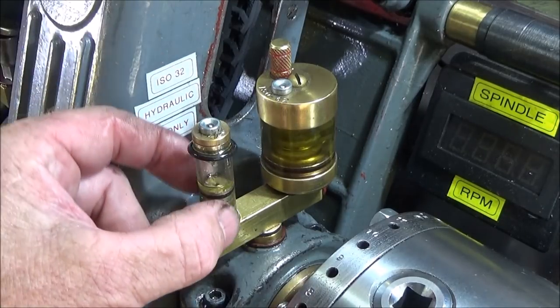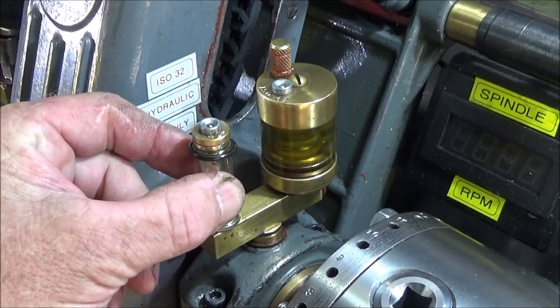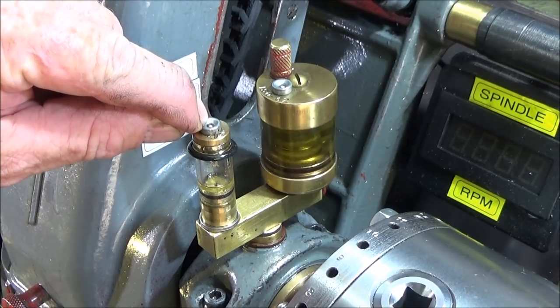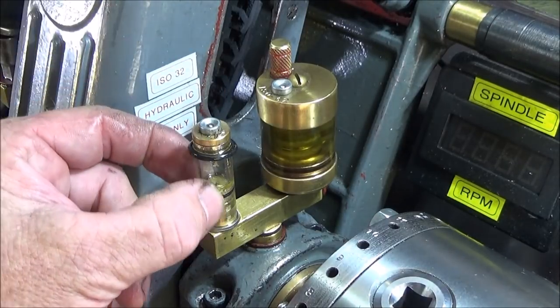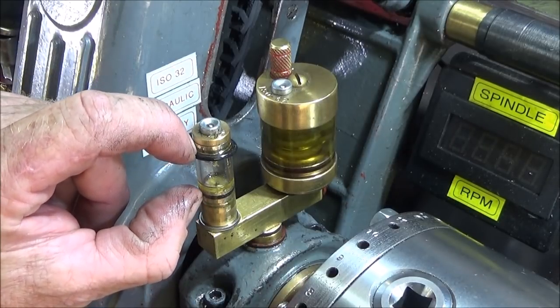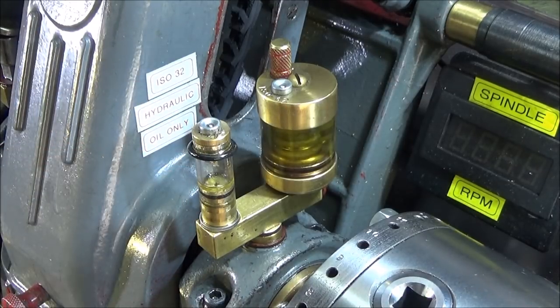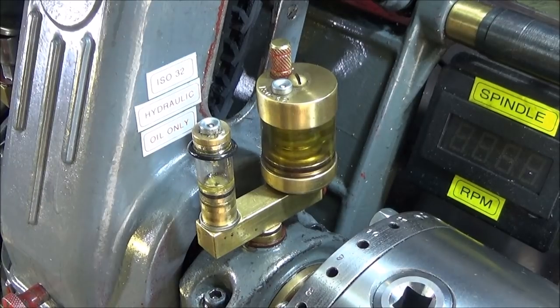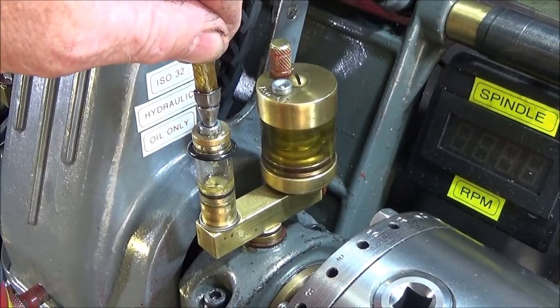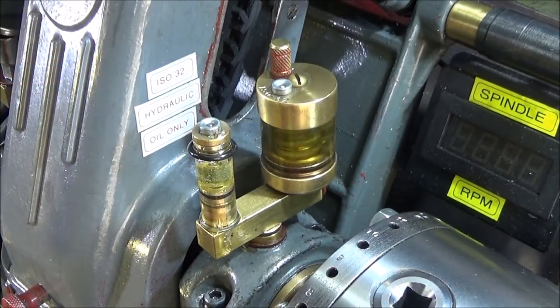And this is an ordinary straight through hole in a polycarbonate like cylinder here, with a button oiler on the top here, and I can actually squirt oil into that one and have that much oil, which is roughly about 10 cc's of oil, maybe a bit more than that, maybe 20 cc's of oil, and that's just enough to keep it going perfectly and stopping the bearing drying out in use if you're just using it for a short period of time. So to fill that one, I just put my oil can on the top and give it a squirt of oil and fill that one up.